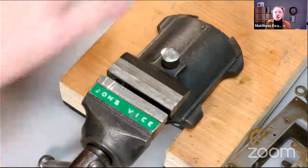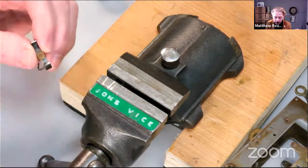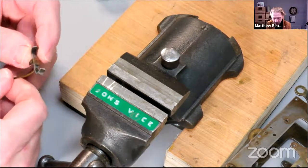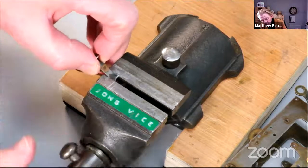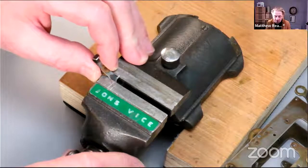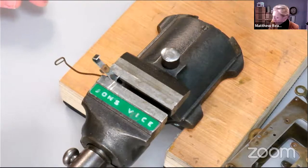So there's two things we could do here. We could either let the pallet down by heating it and allowing it to cool slowly. Then we'd have to harden it again at the end of the process. It might be actually worth doing that, because otherwise we're going to have to do it with diamond. Let's just try it with diamond and see how that goes, and if it doesn't work, we'll have to let it down. The reason why letting it down might be useful is because I have had these pallet frames break before. They're actually that hard, so annealing might be useful.